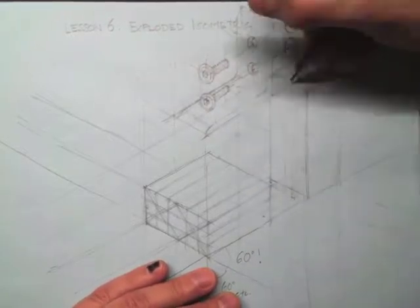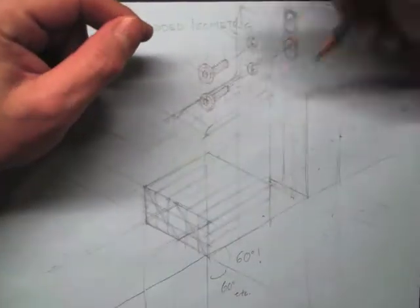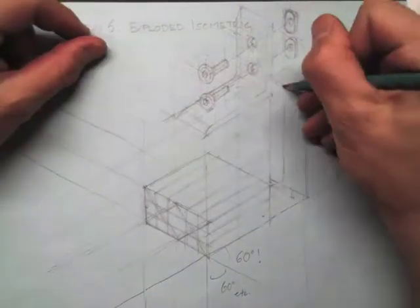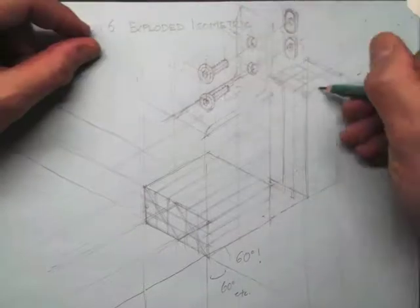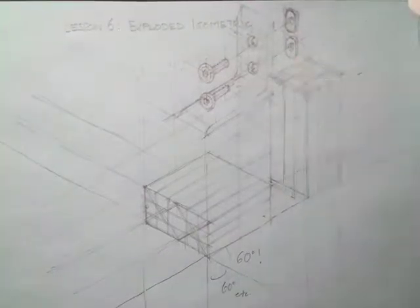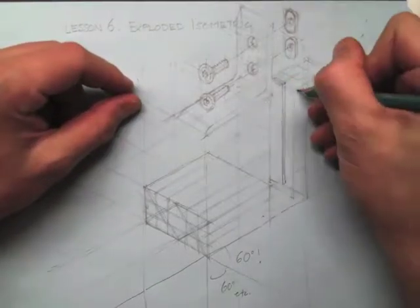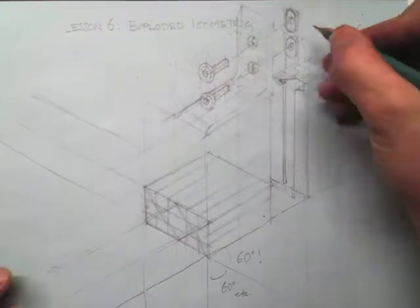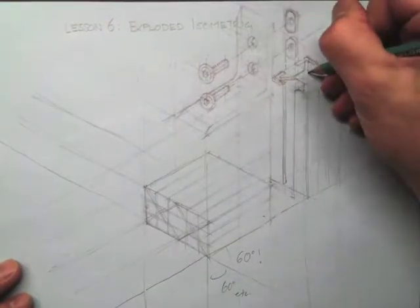And look, there's just enough room, it looks like, to fit it in here. So I'm going to draw just the guiding geometries of the part, lay out the place where the detail will go, and make sure that the various parts and pieces line up. In this case, the nuts slide down into that slot on the piece of 80-20. So I'm going to do a little bit of detail work to make sure that that alignment is maintained.